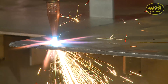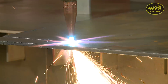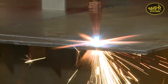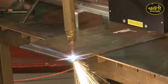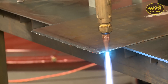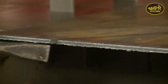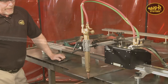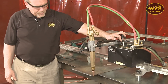Note the smooth, consistent travel — constant speed, constant path — producing a premium cut. If you've ever tried to cut a piece of steel like this with a hand oxy-fuel torch, getting a straight consistent line is fairly difficult even for the best cutters. With this machine, even a novice can make a fairly good cut. Here you can see the results of mechanization — to make a cut that straight, that smooth, that concise by hand is almost impossible. The simple principle of controlled rate and path produces quality results.